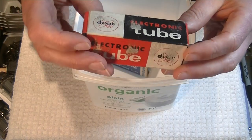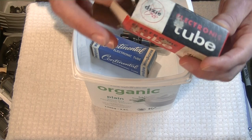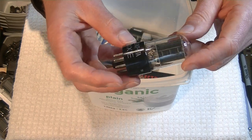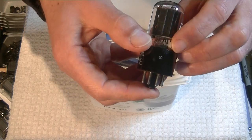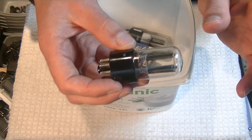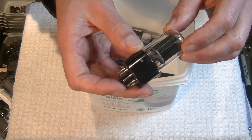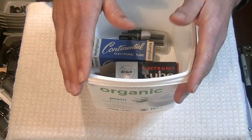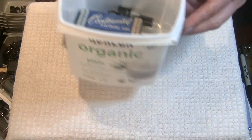This is the one I wanted to show you. I've come across Dixie tubes before — this is a rebrand, of course. At first glance it looks like an RCA with flat black plates — another 12SN7. It's got a large D-getter down there. But take a look at this — see that on the glass? Japan. And I love Japanese-made tubes. So many of them are just absolutely wonderful. One of the secrets to that is that many of the Japanese manufacturing plants were set up by Mullard Philips. Often you'll get a tube that looks — heck, that 12AX7 looks an awful lot like a Mullard, and it builds like a Mullard. Well, guess who set up that plant? There's a good hint for everyone.